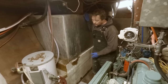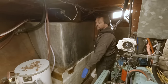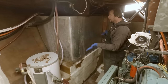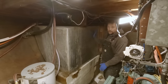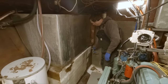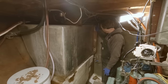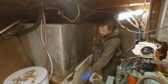It could be issues. We are going to go ahead and bust this out, because this tank over here is movable right now. We've got the room to pull this out and move it and inspect it. We can lift it up enough to get underneath and inspect the integrity of this tank. It's empty right now because we plumbed in new valves, new hardware, and a new sight glass, so it's not an issue to get at. It's just as simple as removing this big support right here and this one up here and cutting this away.